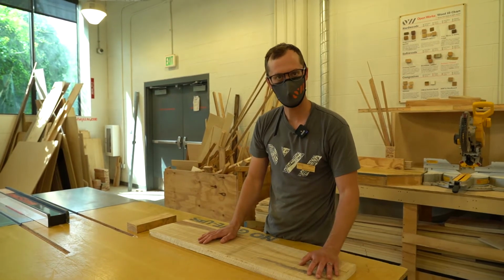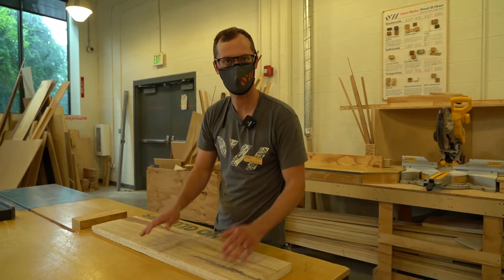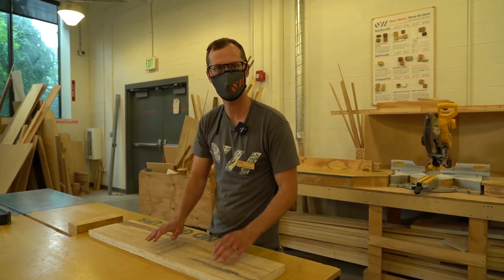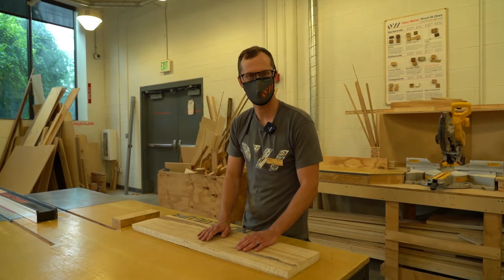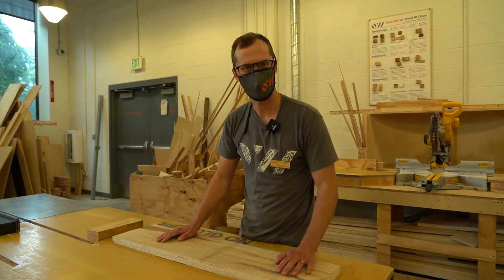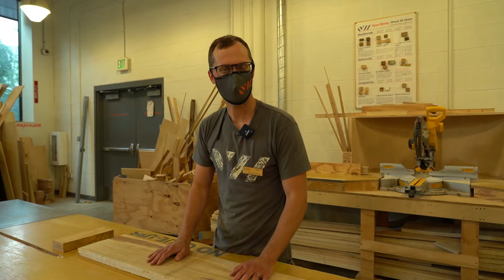Now, as you communicate with the sawmill, they're going to say, we have a bunch of planks at 5/4 thick, for instance, and then they'll cut it to width that you like. 5/4 means it's 1.25 inches thick, and then you're going to have to do the math to figure out how many board feet you need at what finished dimension for whatever project you're trying to accomplish. Other sawmills will also sometimes have pre-manufactured widths, and they'll just sell you by the board, the linear foot, and then you just tell them the length of the board that you want. Board foot can get a little complicated, and it's easy to get sideways. Usually the folks you're purchasing lumber from will help walk you through the process.